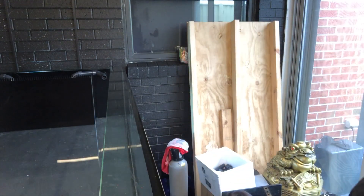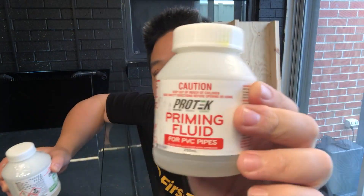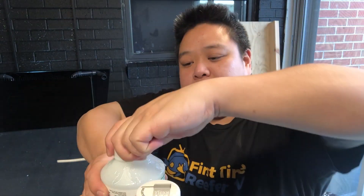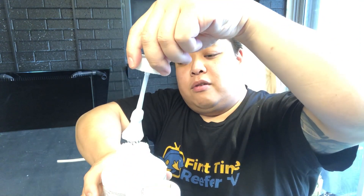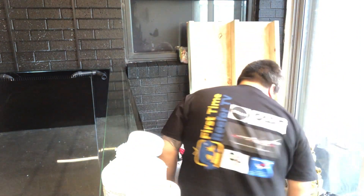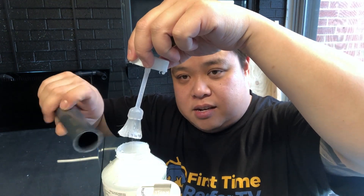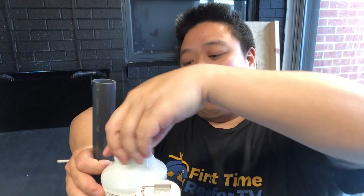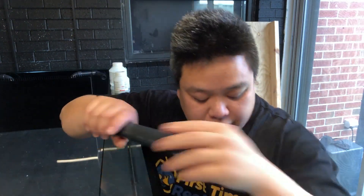When it comes time to gluing, you've got a priming fluid here which is just to clean all of your fittings, and then this one here is a PVC cement. The glue is very, very thick. Once you've cleaned it all, just get it in there — this is what Billy showed me. Hold the brush up and don't move it around, just roll your pipe through it. Put a good amount of glue on the outside and then just shove it into the fitting. Dry fit everything first before gluing, because it can be a little intricate and you can make a mistake. You can misjudge how much you need or mismeasure. So measure three times and cut once.